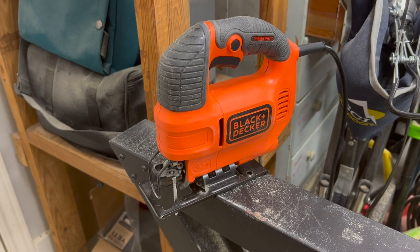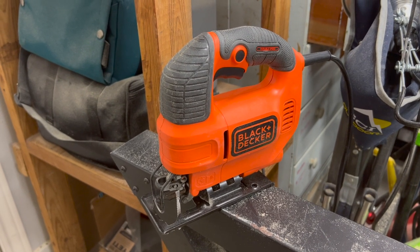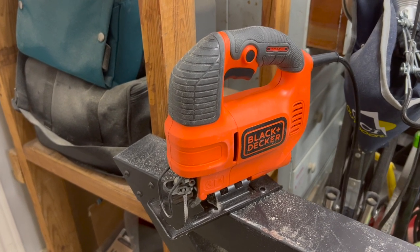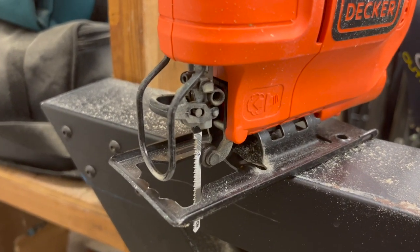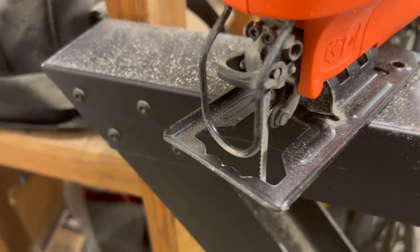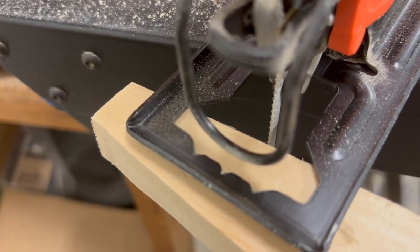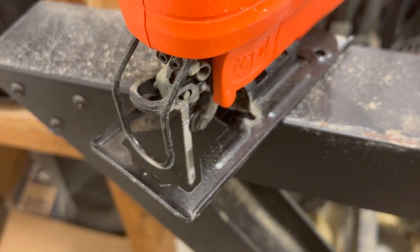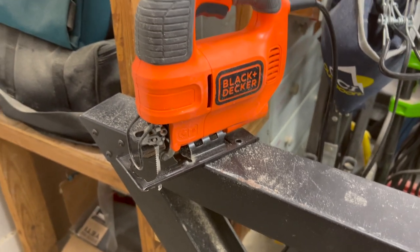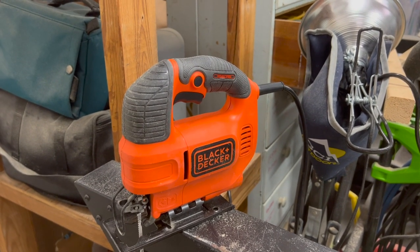In this video I'll be using my jigsaw. This is a Black and Decker with an interchangeable blade. I don't have a scroll saw, and I tend to cut things with curves, so I use the thinner blade. The jigsaw has a guide on the front to help when you're cutting, and it's important to keep that foot portion flat on your wood piece. You'll see those notches — those are the guides. Don't rush when you're cutting, especially on the more intricate parts, or you'll overcut or mess things up.